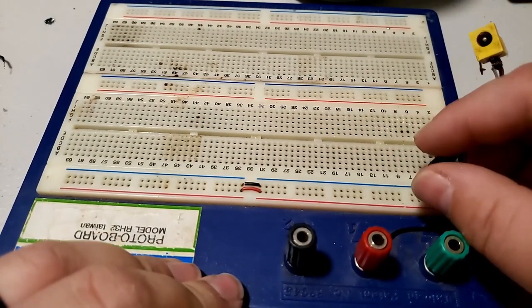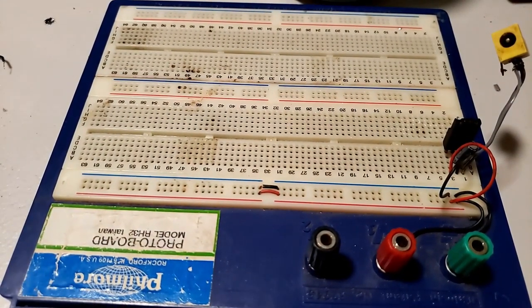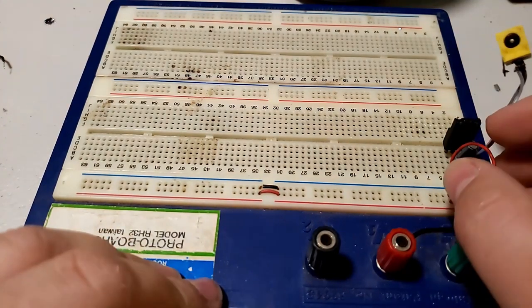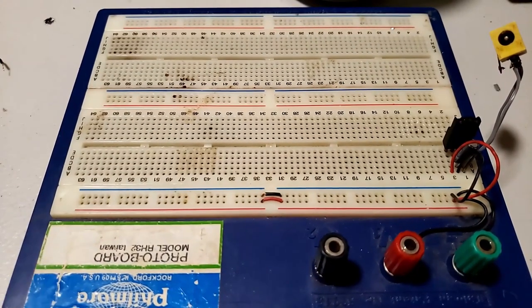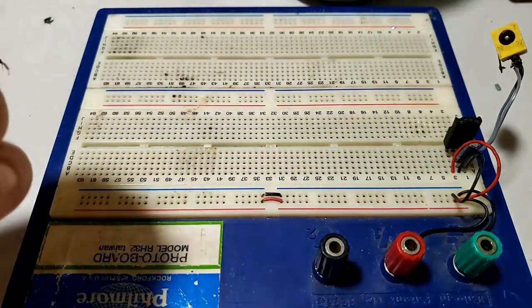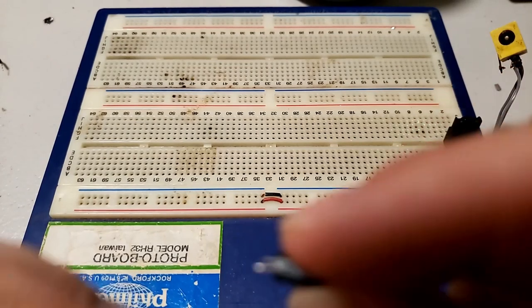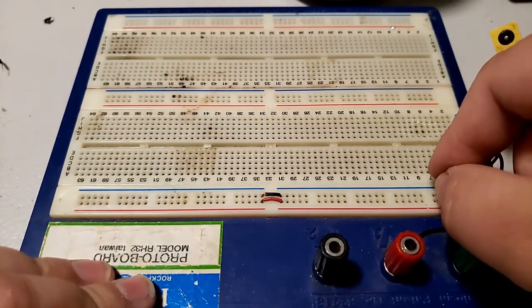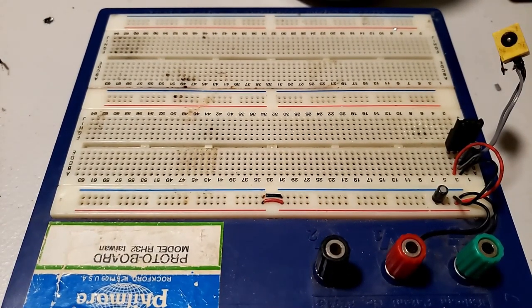The manual says you're supposed to have a capacitor, so I've got a capacitor between the input and the ground — I'm going to pop that in. Here we have our barrel jack, and I went ahead and soldered some of that wire from the connector on. Our tip is our positive, so we're going to hook the positive and the negative in right here. I'll stick that negative up top for a reason you'll see later. So now we've got our power coming in. The negative we're going to run down to this negative bus on the bottom. From the positive output, I'm going to hook in a red wire and run that down to the positive. This is stranded wire — it's best to use solid core wire, but this is what we've got. Red wire versus black wire doesn't matter at all electrically, but for us it makes it easy to keep track of what's running where — so when possible, I try to use correctly color-coded wire.